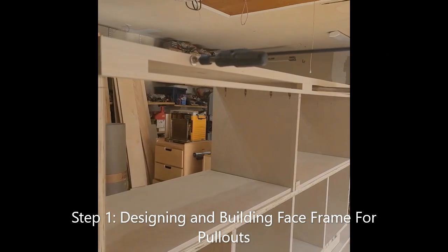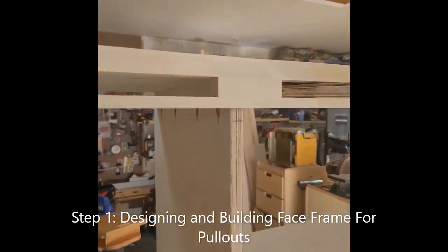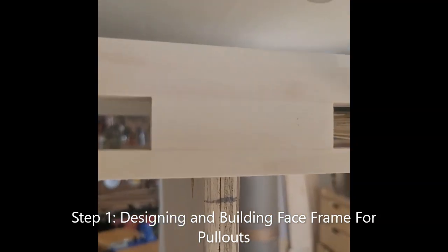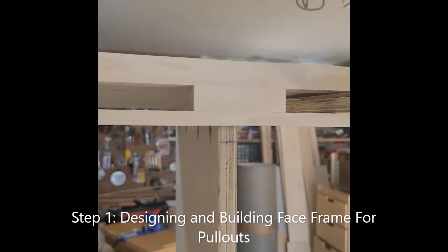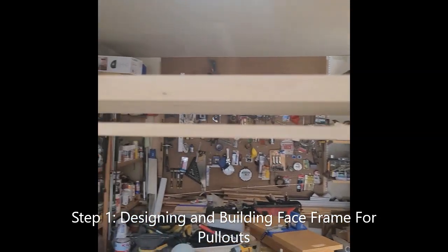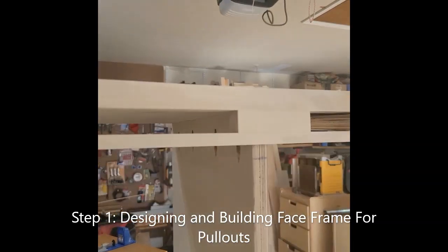which will be above. And to do this, I made this about 7/8 of an inch thick, and I actually glued pieces of 7/8 wood between the top and bottom piece so it would be perfectly rectangle instead of trying to cut out this rectangle on a bandsaw or something like that.